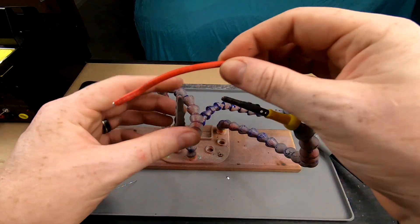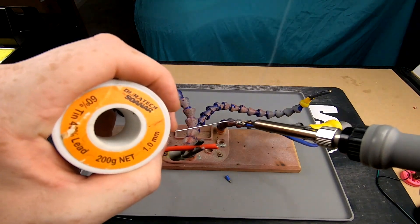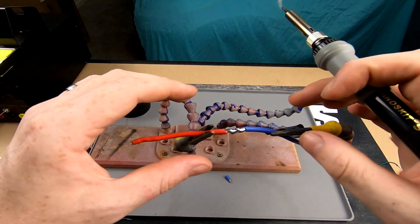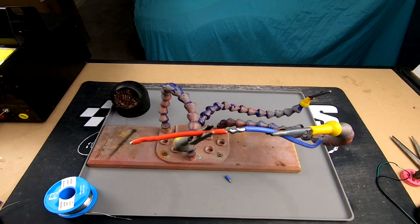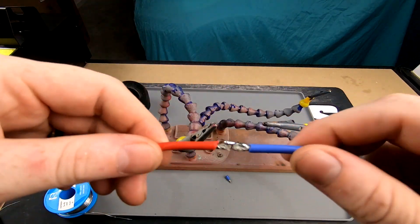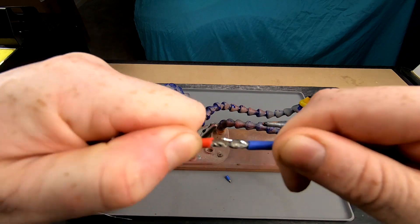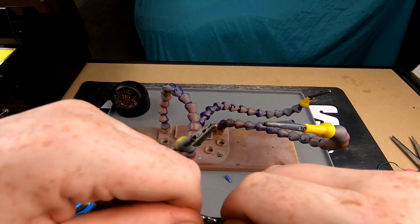Let's go up and try some 12 gauge wire, which is your standard size for an RC car. Once again not the prettiest, but this is just for demonstration purposes. Let's have a look and see how well it penetrated — you can see it hasn't quite penetrated all the way through. But the joint itself is still super strong — that's all my strength and I cannot break that joint, so it's still providing a nice strong join.